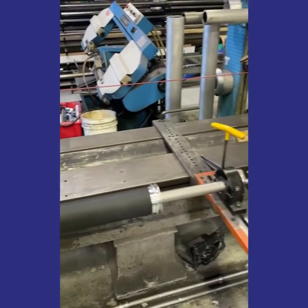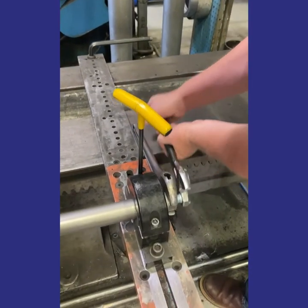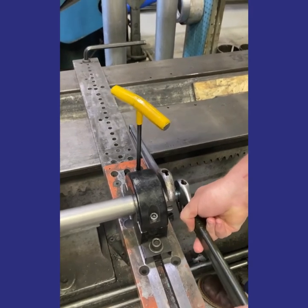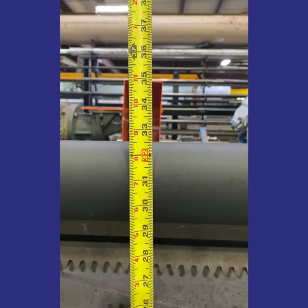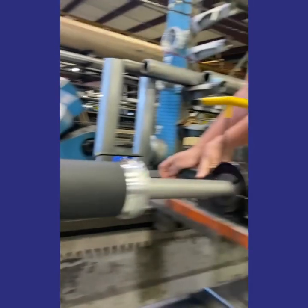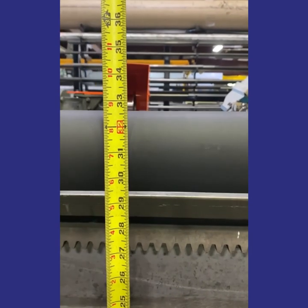So we're going to go ahead and start turning the end — use a crescent wrench, hold the shaft part fixed, and then rotate your lead screw. You don't want to rotate too many times, maybe only one or so revolutions, especially on the shorter ones. You can see this bowing as we go here until we are just about at 33.